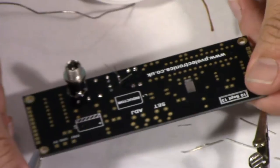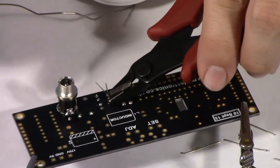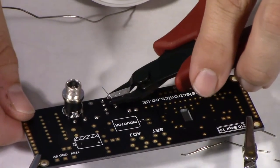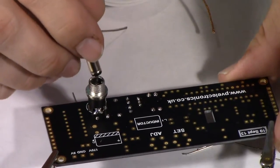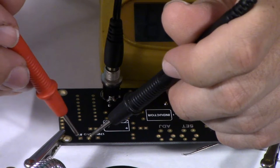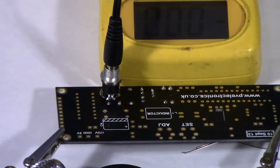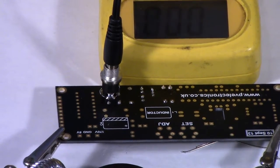That'll teach me. Going for round two with the power test now that the voltage regulator is installed. It's reading 4.67 volts — we're supposed to get 5.5 to 5.8. The power supply only read about 10 volts when it was supposed to read 12, so I'm just going to go with this. It could be wrong, but I'm just doing this for fun.